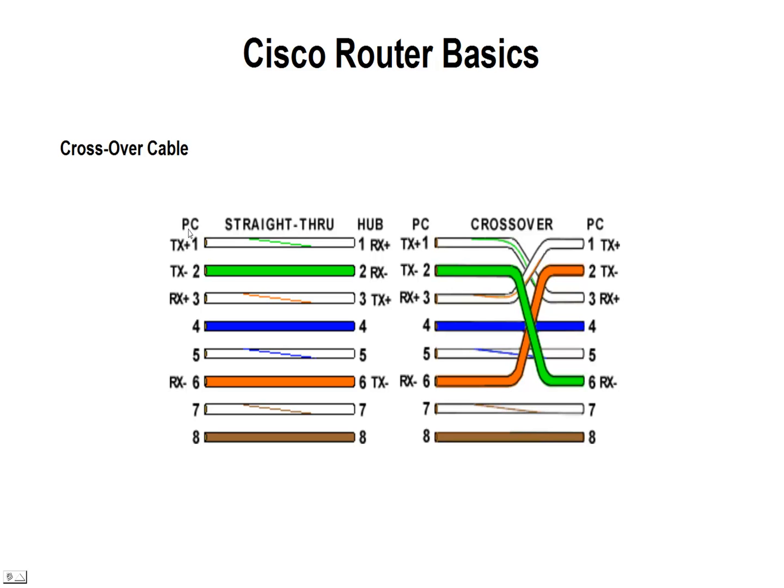You can see we have two wires used for transmit of the packets and two wires for the receive. Pins one and two are normally reserved for transmit, and then three and six for the receive. On the other side of this cable, if we connect to a hub or a switch, it is automatically going to transfer our transmit side to the receive side. That's internally done if you're connecting to a switch or a hub.